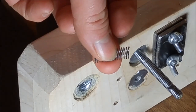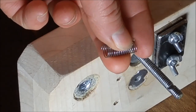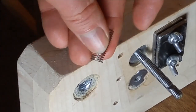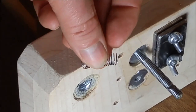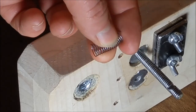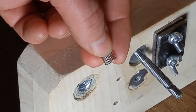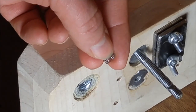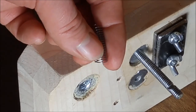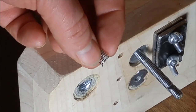The next step after running the wire through the spring making jig is, depending upon the spring you want, to clip off the excess wire on each end — I did that with a pair of clippers — or you could use a Dremel tool. I find that with larger diameter wire the Dremel tool is a much better option. You have a lot more control over where you want to cut, and you don't affect the spring at all, whereas with clippers it can actually end up bending the wire trying to get them in there to make the cut.